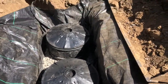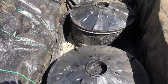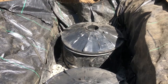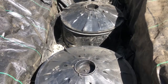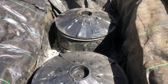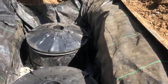We've got our second layer of fabric from the outside, tucked in behind that first layer, and that'll allow us to bring the round rock up to the very brim on the sides of these containers. I just put a little bit of rock inside the bottom of each one to stabilize it so it wouldn't move around or deform. Put the caps on to keep them solid and then continue to fill your rocks in around the outside of them.